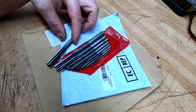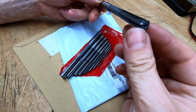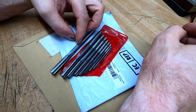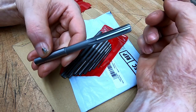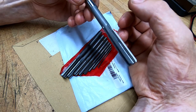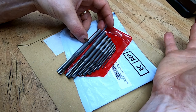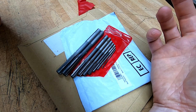In my opinion, they're not too bad. They don't quite hit the tolerance they say they're going to hit, but as long as you know what they can do and you use them for appropriate jobs, I think this was best part 20 pounds for a 2 to 10mm set. So if you want to do mega accuracy holes, you want to buy a decent reamer. But if you want to have a play around with these, they're probably worth a punt. I did make sure I chose one that didn't explicitly say it had to be used on soft materials — a number of these said they would only be good for wood, plastic, aluminium, that sort of thing. This one did say it would do steel and brass as well, and they seem to work. Hope you enjoyed that, and thanks for watching.